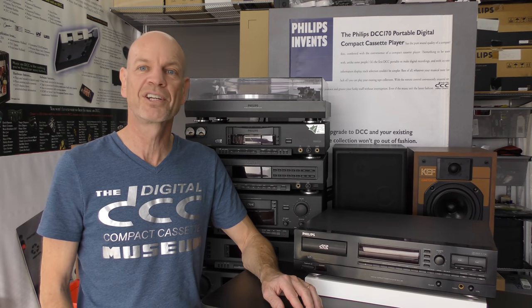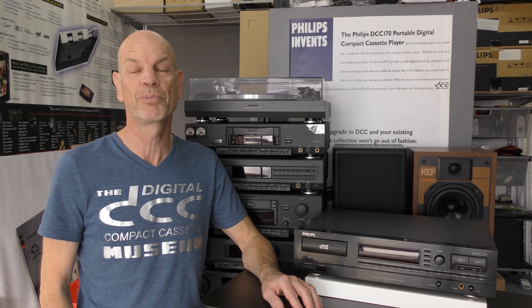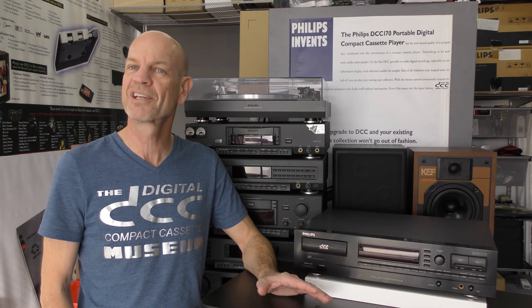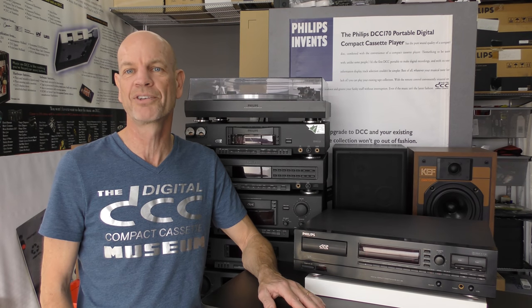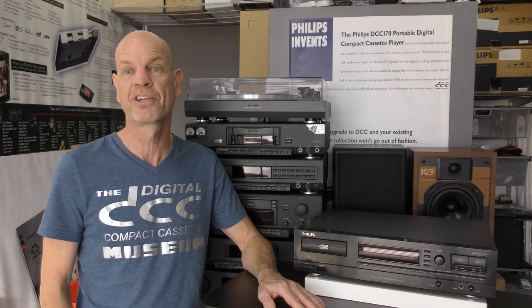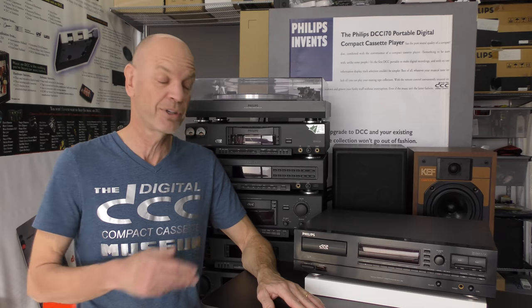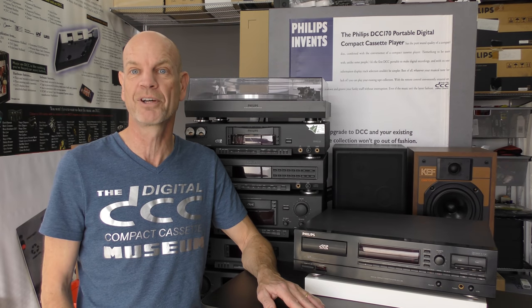The second generation has a digital input and a digital output but no optical output. When we were visiting Christophe Zietar last year in Poland, he showed us an upgrade he had made because he refused to use any external boxes converting a digital output to an optical output. He created a direct optical output from the board of the 600, gave us a schedule and some homework, and in this video we're going to show you how it's done.